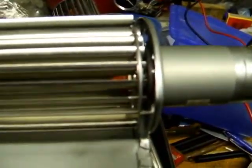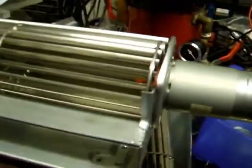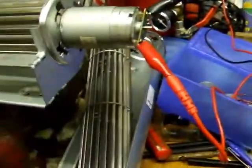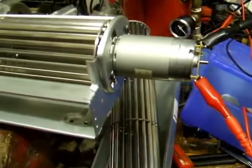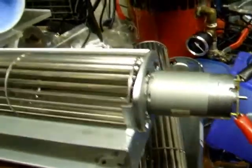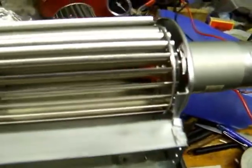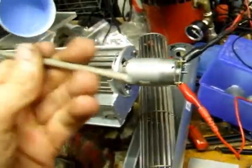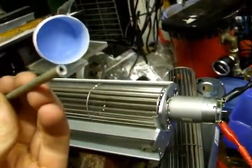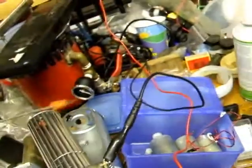You might just be able to see them in there. I glued a little bit of aluminium tube over the spindle, which is splined, so it should hold. I've used some epoxy adhesive to hold it on. It's got a bit of that left over here because this came from an old set of science gear, I think. You can see the bung on it. The tube is 6mm outside, and the inside is close enough to the spindle.